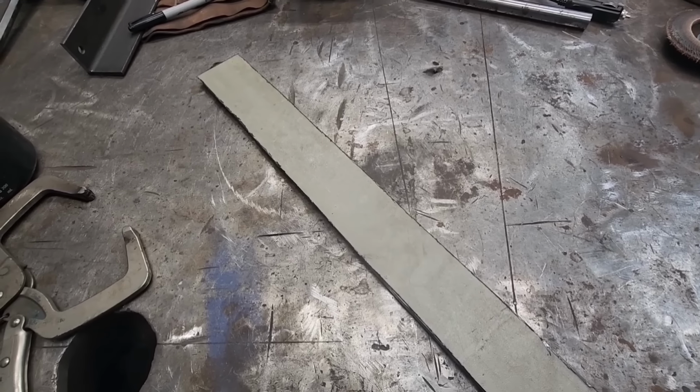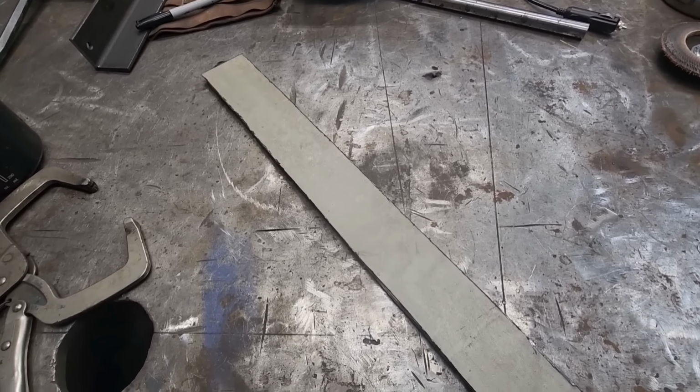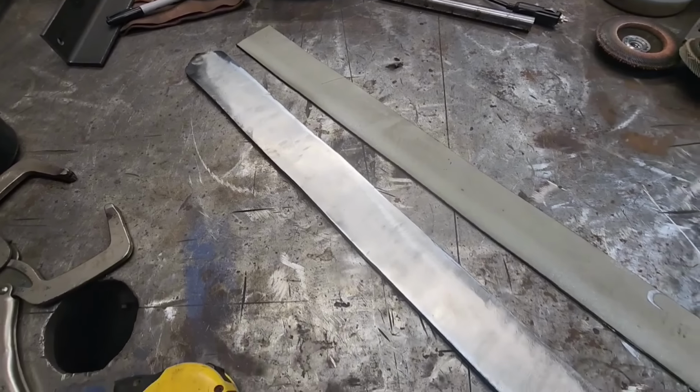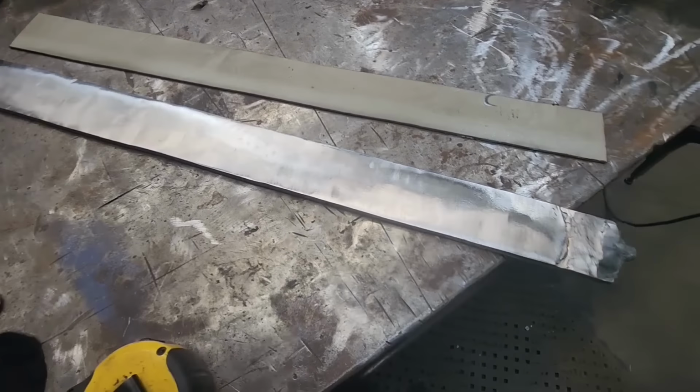And I'm gonna try and draw this out another couple inches. Try to get the billet really close to 1/4 inch all the way through. Keep that copper in there. Probably get these off and then stretch her out again, clean it up. And I think I'll be looking at exactly what I want.